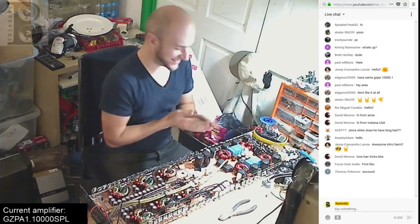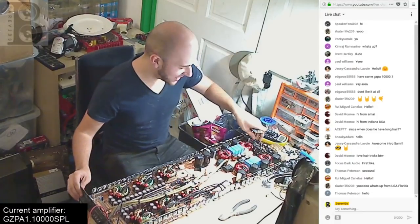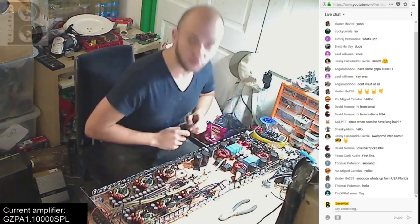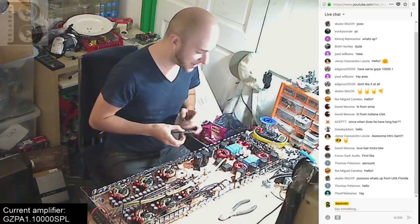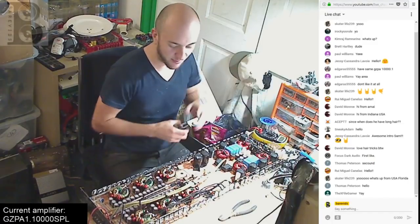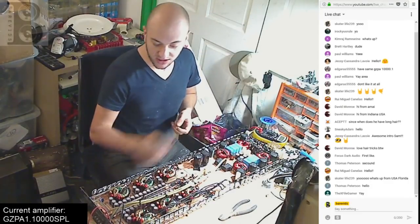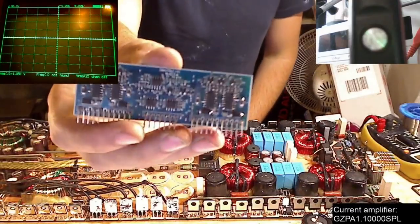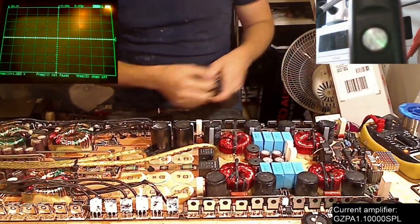It's a Wednesday evening and I've discovered some interesting issues. Let's have a look at this Ground Zero massive piece of hardware. This is the old Ground Zero 10k — the higher voltage one. It does about 10k at 18 volts, about 8k at 14 volts, so it's basically an 8k amplifier. We're using 500 volt FETs on the output section because it's an 18 volt rated amplifier, and 064 FETs on the power supply. It uses the classic IRF 21844S driver board with four IRF 21844S drive chips.